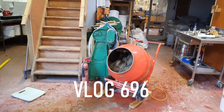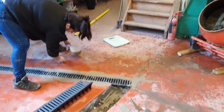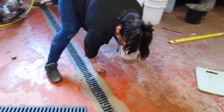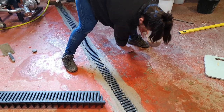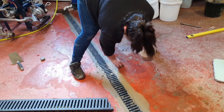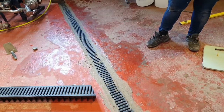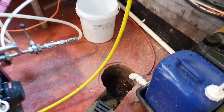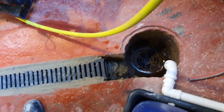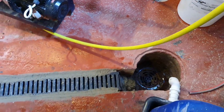Good morning ladies and gentlemen, we've got Gemma working hard — she's done a really good job laying that soak away. We're just finalizing this section here, giving it a clean up before we go back in to finish off the pointing. We've got the drainage channel in, and also underneath the drainage channel we've sunk the underneath section of drainage — the outlet pipe — and that's all in.